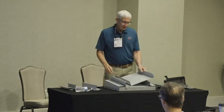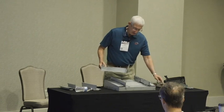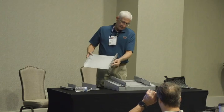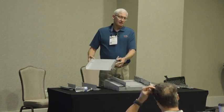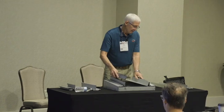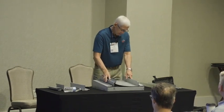And then there's the fact that you can't ever fix this. So for me, it's all about this idea of individual panel replaceability. These panels have a fixed clip. The clip sits inside the hem, and the panel moves back and forth on a fixed clip. So you don't have to worry about where the clip is, or if you need a fixed clip or a floating clip, it's always going to be a fixed clip. And the panel snaps down to the clips.